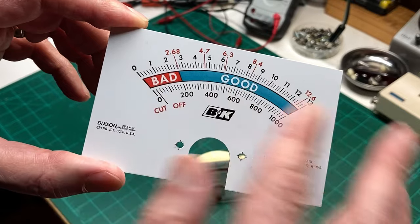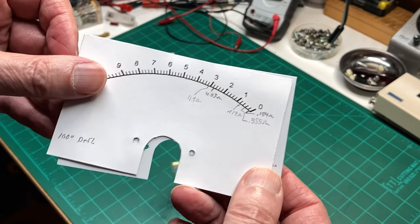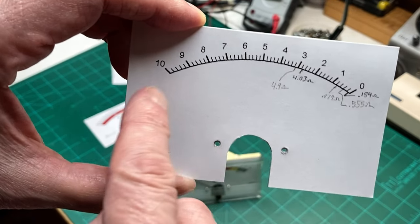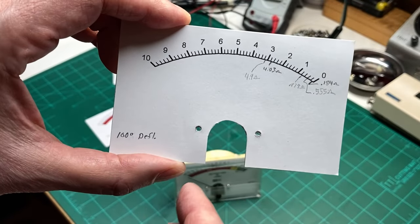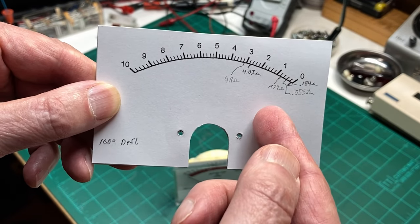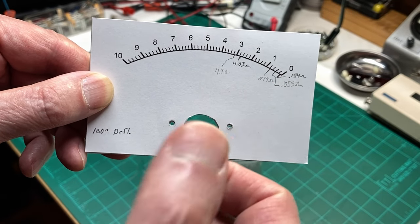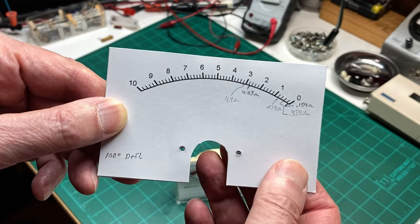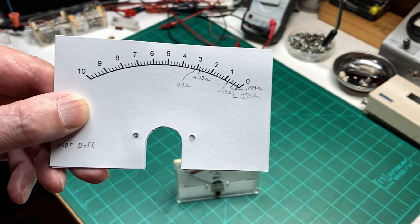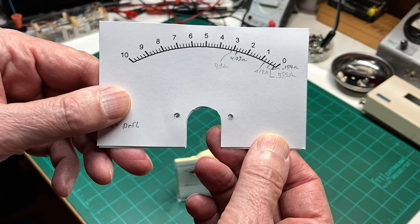So what I did was in the meter program, I built a scale of this that was reversed from 10 to 0. Of course, most meters go 0 to 10, but in this case, the way this circuit is set up, I wanted to do a 10 to 0. So when you set your original voltage or initial voltage for the battery, you set it at 0, and then when you apply a load to it, of course, it will read less voltage, and then you can calculate using any one of a number of internet calculators to calculate ESR in a battery.